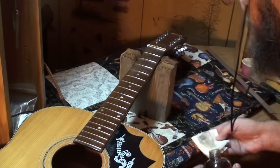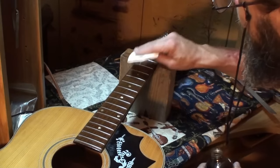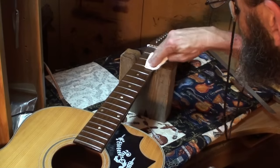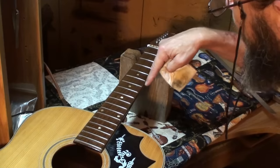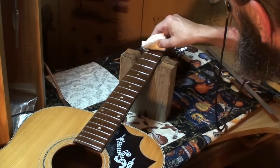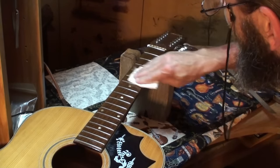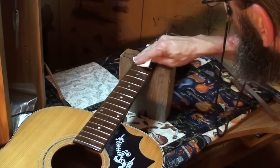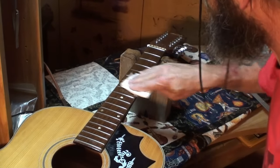And there's a big chip knocked out of the board right there. Didn't see that before. Right there, I doubt the camera's picking it up. Take some rosewood dust, dump it in that hole, drop one drop of cyanoacrylate glue, CA super glue, one drop, let that cure, sand it away, and you would never ever know that there's a hole there. You'd never be able to tell it.